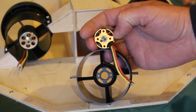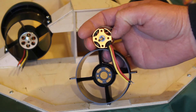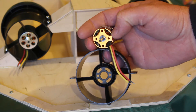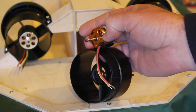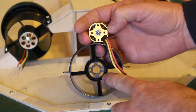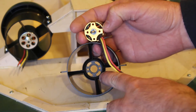I've now started the process of mounting the brushless motors into the EDF housing. But there's a little design flaw — a mod that needs to be done on the housing. You can see that the cables come out the front of the motor, and where the cables come out you're going to need to enlarge this hole here in the housing to allow the cables to come through.